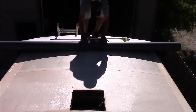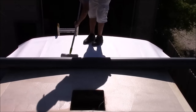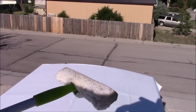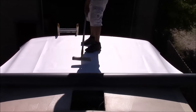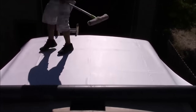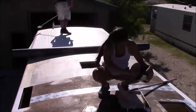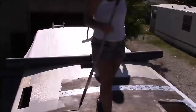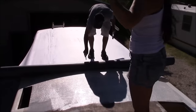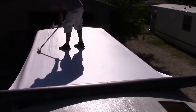Now I'm going to roll out about four feet of roofing and start pushing all the air bubbles out. You can either use a stiff broom or what I'm using — a window mop with a rigid plastic piece inside — which lets me push air bubbles out pretty easily. Some creases and air bubbles might take time; the roofing material may have to sit in the sun to relax so you can push them out easier. Be careful as you're covering any holes — I marked them with a marker so I didn't step in and damage the roof or hurt myself. Try to install this with it at least 75 degrees or hotter so the roof is more pliable; in colder weather the roofing can be very stiff and you're going to have a hard time.